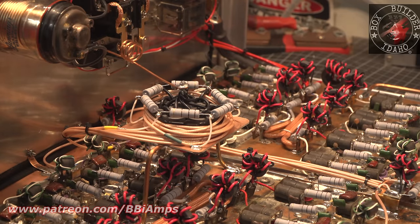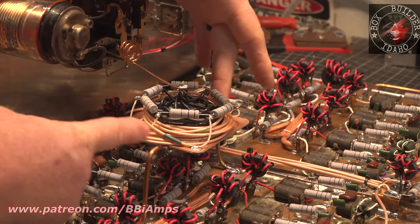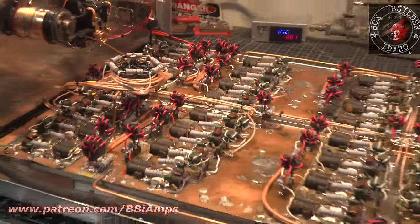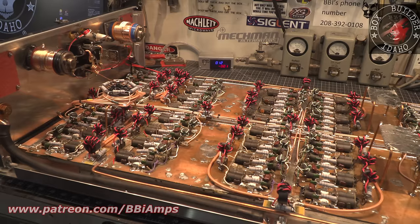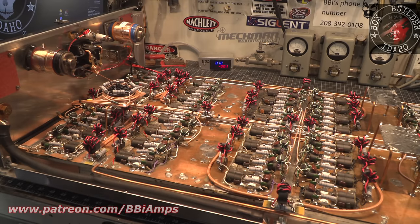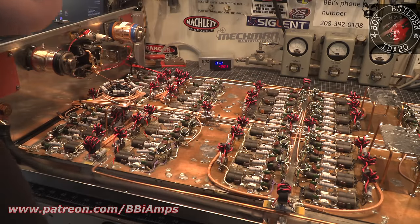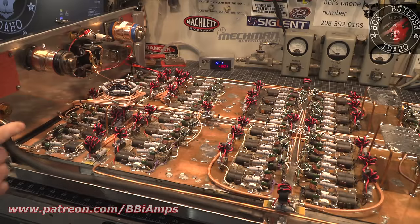Well, the trade-off. I can slide this over, like the way I have this mounted, I can move this over just a little bit further. The problem is now I start covering up my transistors. Now let's just think for a minute that this thing is used and abused and slapped on the butt, and it's most likely going to blow yet another 2 or 3 or 10 pills in its life, right? So I need to make it so somebody like myself can get in here, pull the flybacks out, pull the transistor out, place a 10 ohm. We have to allow access to all the transistors.